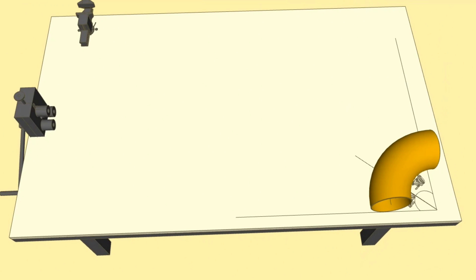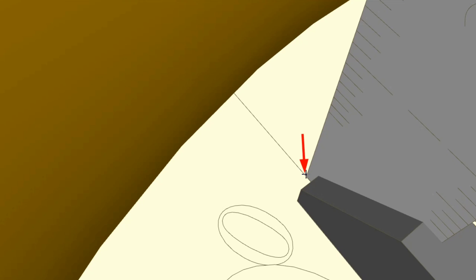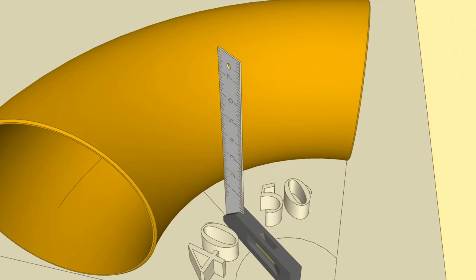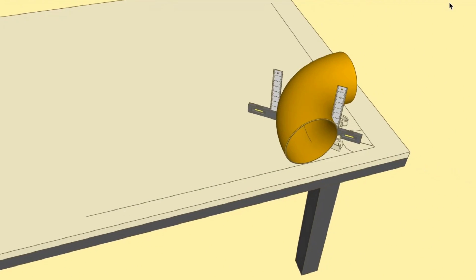On the next step we are using a Tri-square Right Angle Tool. The square angle must sit on the common line of the 40 degree and 50 degree angles. We check that the Tri-square angle is exactly on the common line of the 50 and 40 degree angles from the front and back. After making sure the Tri-square angle is above the common line, we mark the places where the Tri-square angle touches the 90 degree elbow.